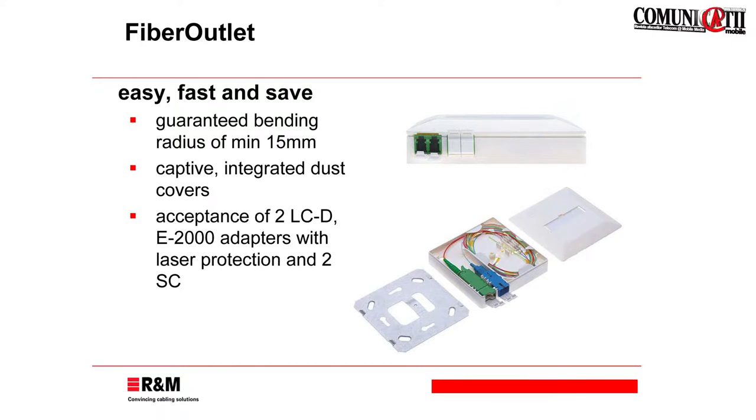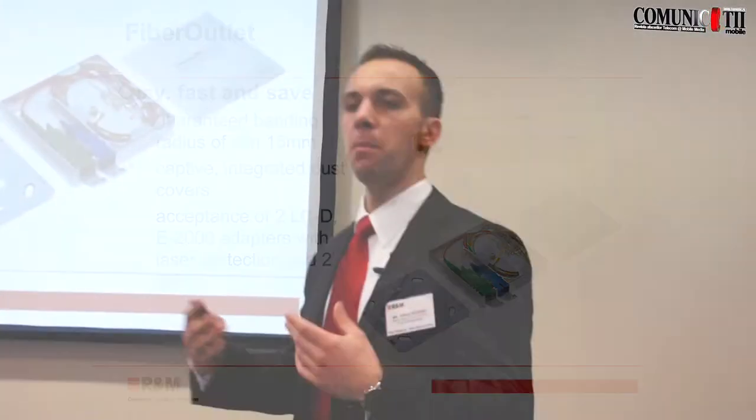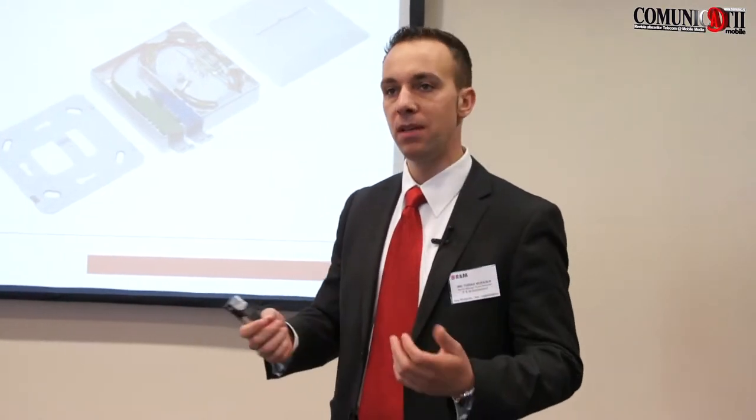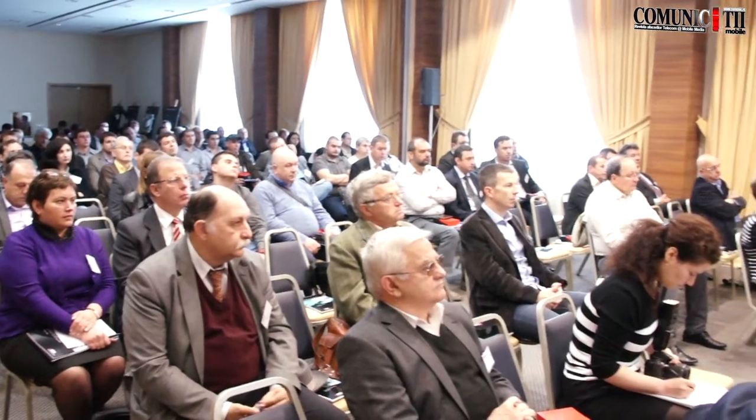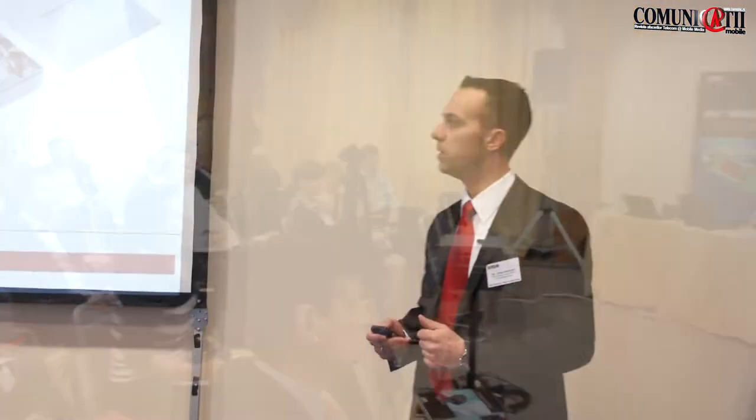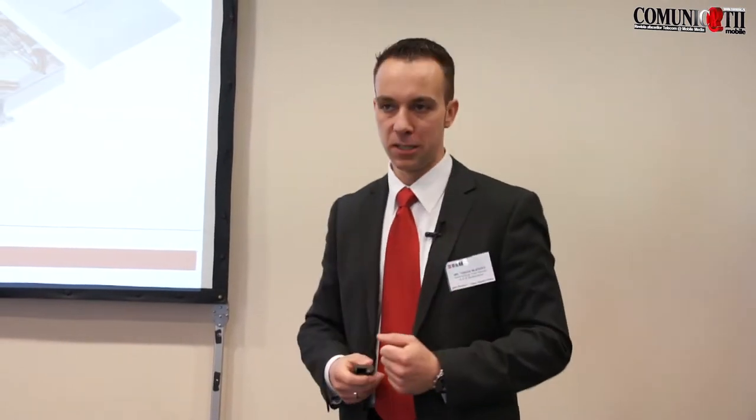You can see that the outlets are really small. The bending radius is only 15 millimeters. That means those outlets are optimized for the low bending fiber types, which are mainly used in the customer premise area. In an outside plant area, for example, you have the standard G652.D fiber type, where the bending radius needs to be a minimum of 25-30 millimeters. In general, the higher the bending radius, the more long-term stable it is. In the customer premise area, you use low bending fiber types because of installation circumstances — you don't always have that 40 or 30 millimeter bending radius. This is why we have these 15 millimeters with the new fiber types.